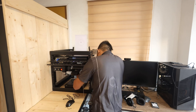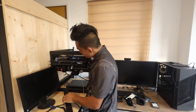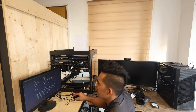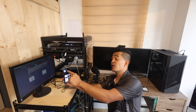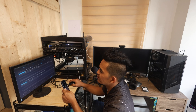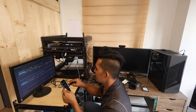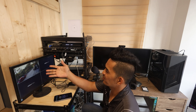After screwing that closed, we need to set up the NVR connected to the network. My network rack is piling up, so I need a monitor. I'll add this one to the network, plug it, and power it up. We need to do the initial configurations like password and date — it's very important because of the recording and all other things. They have an app called DMSS, and we are going to install DMSS. It detected one of the Amcrest CCTVs that I have. So this is the Dahua, but it can detect the other brand CCTV too. And this is recording already — that's cool.